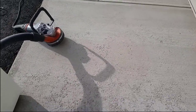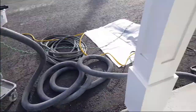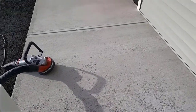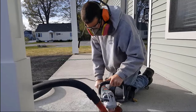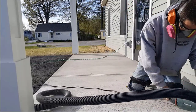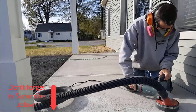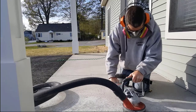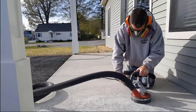We're going to prepare this today by dry grinding it. I've got my diamond grinder there with a vacuum. This will clean off all the loose concrete and the dirt, and get it prepared for the concrete dressing. We've got to get all that loose concrete off — the prep work is one of the most important parts of doing concrete repair. We've got to get this concrete back down to sound concrete, and then we can put the repair to it. Sometimes the easiest way to get that spalled concrete off is just to lightly grind it — that'll remove all that loose stuff and get us back down to a good concrete base.